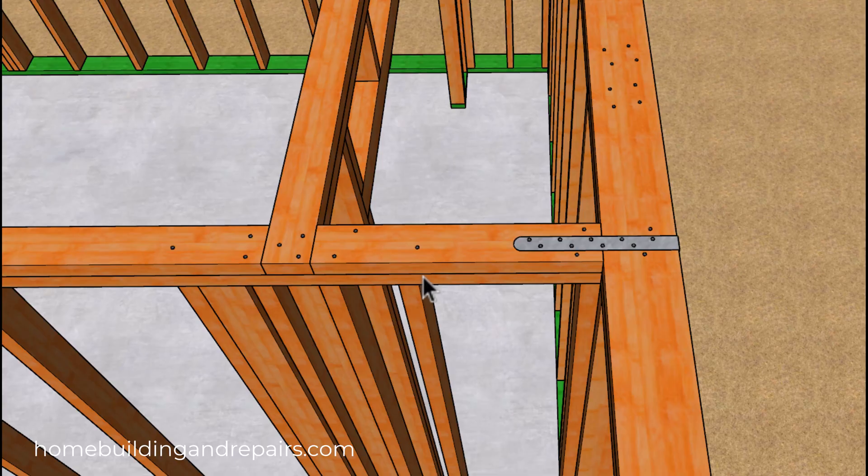We have a lower and upper framing plate. You can see where I have a couple of nails at the end of the plates, along with some nails where the top framing plate will extend over to connect to the other wall. We refer to these as an ear and a channel — the overhang is the ear and the section it connects to is the channel.